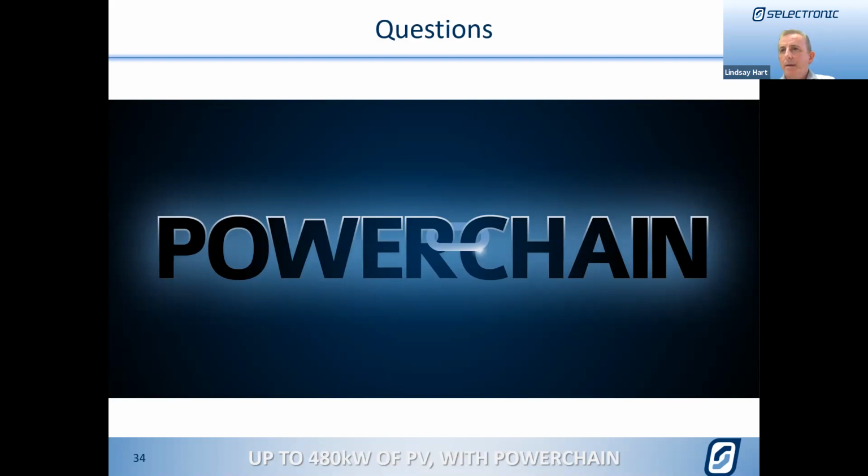All right, and again, Kerry from across the ditch. G'day, Kerry. Hope you're well. Kerry mentioned that we can have a Fronius and Select Sun on a multiple three-phase system. So what was happening there is that a phase manager can only manage one type of inverter. So we had L1's phase manager talking to some Fronius, and we had L2's phase manager talking to Fronius, and then L3 was talking to Select Sun. So the manager on that phase can only manage one language, if you like. If it's a single phase, then they have to be one or the other. You can't have a Fronius and an ABB on a single phase situation.